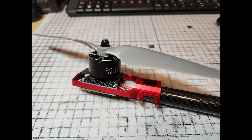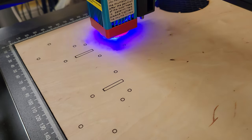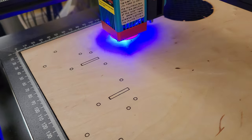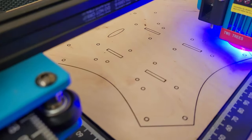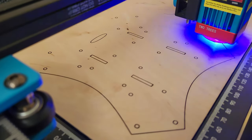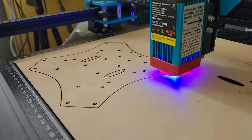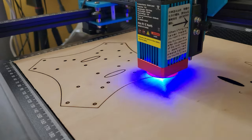The first project is a sort of mini beast quad, with the motor stuck on the end of the tube just to check fitment. I then designed and cut some plates out of light ply — I believe one and a half millimeter light ply — with the final carbon fiber version being three millimeter. This is cutting on my little laser cutter; the place smells wonderful now with burnt wood.